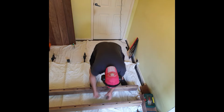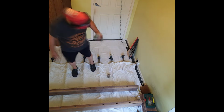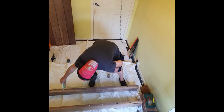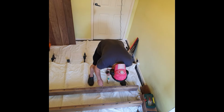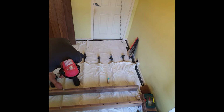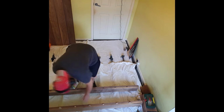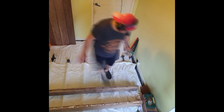Now, as you see, I take my time with the glue. I make sure all the holes are evenly filled with the glue. Now you will see that I place the dominoes inside and then place them back with extra glue. I will give plentiful glue, so the wood is able to absorb it and have a better grip.